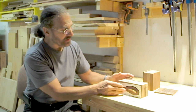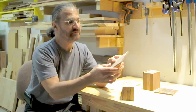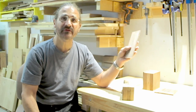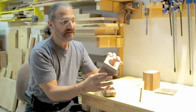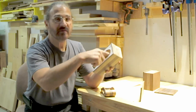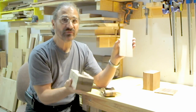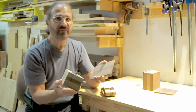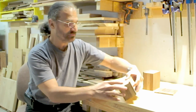So what I do — here's what I'm working on now. What I do instead is when I do my glue up, I use some quarter inch stock that I've had that's already smoothed out, probably run through the planer. I do my glue up, put my template on, cut out my drawer, sand it, and then I take a separate piece of wood — not cut off from the block — that's already smoothed out, and I glue it onto the back. And that becomes part of my glue up.